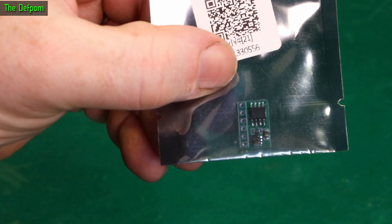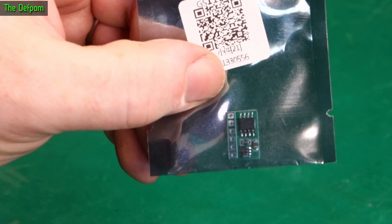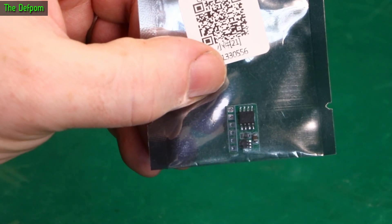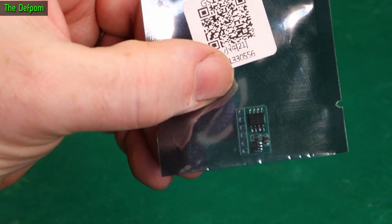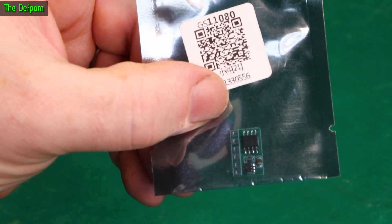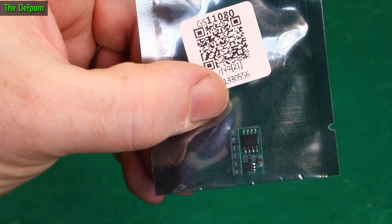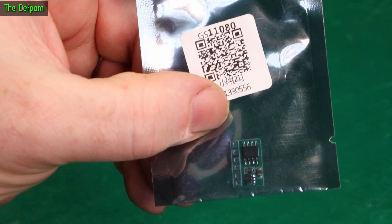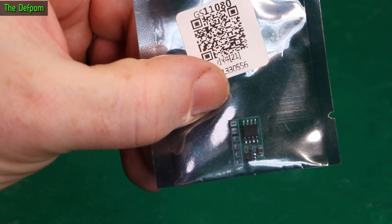So I've got these little switch modules here — it's all part of the project. This is basically a MOSFET with a little switching system. I ended up using a transistor switch, which wasn't quite as good. Basically what I wanted to do is not actually have a relay — I wanted to use a MOSFET, and this is what this will be used for. The idea is that when it's idle, the power is actually turned off completely — it's not in a sleep state, there is no power, it is off. And when the mailbox gets opened, it activates the switch which provides power. The ESP32 then gives its own output from a GPIO pin to latch on its own power supply. And then once it's finished — connecting to my WiFi network and sending me an email — it turns its own power back off again. This would be much better than a relay.